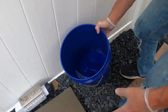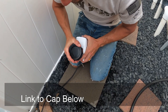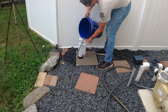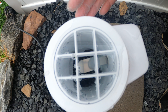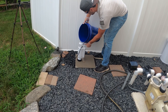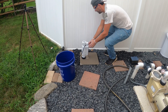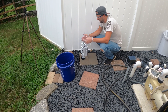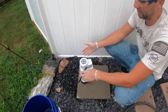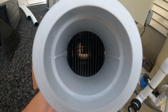Move on to putting the cap on one end of the salt cell, and then we're going to stand the salt cell up on the cap. Now we're going to pour that cleaning solution into the salt cell and cover the fins. What you expect to see is some foaming action, and what that foaming action is doing is actually cleaning the salt cell. It should go for about five to ten minutes. In my case, my salt cell wasn't that dirty — it took about a minute, stopped foaming, and I was done. If yours takes longer, you may have to repeat this process two or three times until it stops foaming. Once it's done, you'll be able to tell because the fins will look clean.